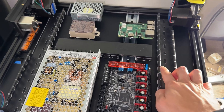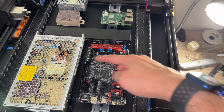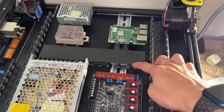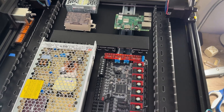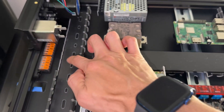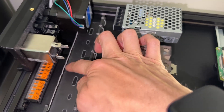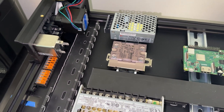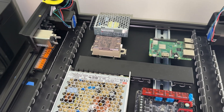I just made a simple H pattern. The Voron kits mount the DIN rails in a perpendicular direction, which gives you more space to do this. I opted not to change my layout. Just make sure you have enough clearance and trim the raceways as required. If you are not confident in your wiring abilities, I would suggest skipping all this until later when you are certain everything works correctly. After all, it's mostly cosmetics.